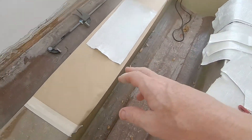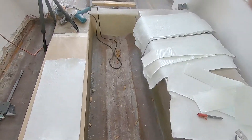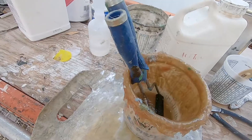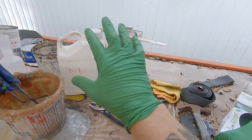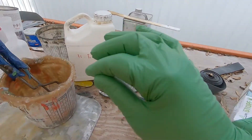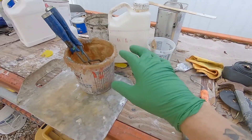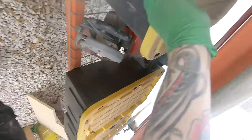Here I've already pre-cut all of my tabbing and I'm getting ready to laminate the tabbing pieces. Before getting into the actual laminating, I want to talk about some of the tools I use and things I've discovered over years of doing this that make life a lot easier. The first thing is, before you get going, you want to put on multiple layers of gloves — I think I have three or four layers on right here. What that does is I use my hands as squeegees, so as the resin starts to kick off I can pull the layers of gloves off my hands, which makes cleaning the tools a lot easier.